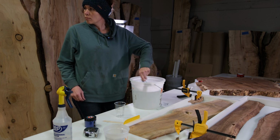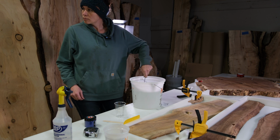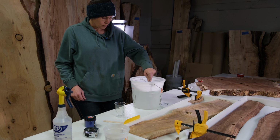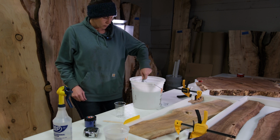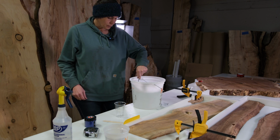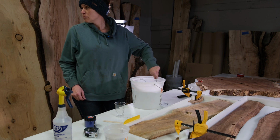Most customers don't have a vacuum chamber that'll pull the dissolved gas out, and so that'll be part of the 20 minute or so resting period, 30 minute resting period. You've got plenty of work time. I mean, you could sit here and mix this for 4 to 6 hours probably before pouring, especially at this temperature. And then we'll mix the color in, and you mentioned baking, right?